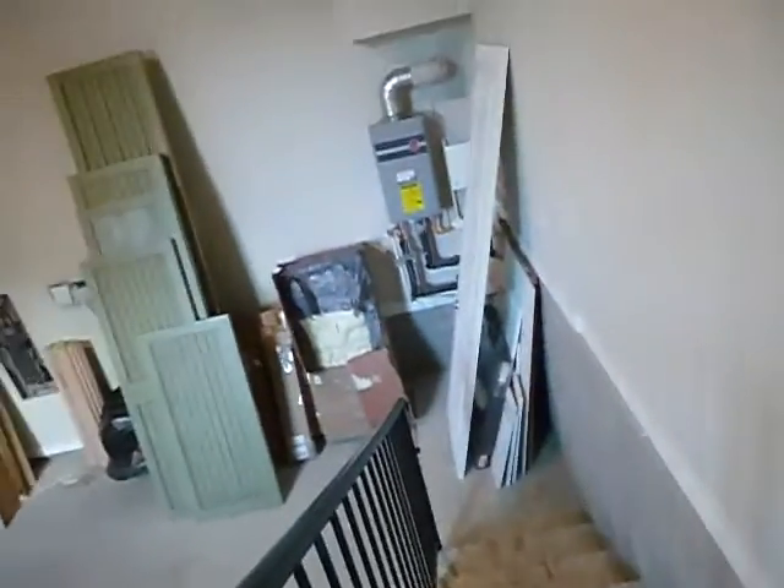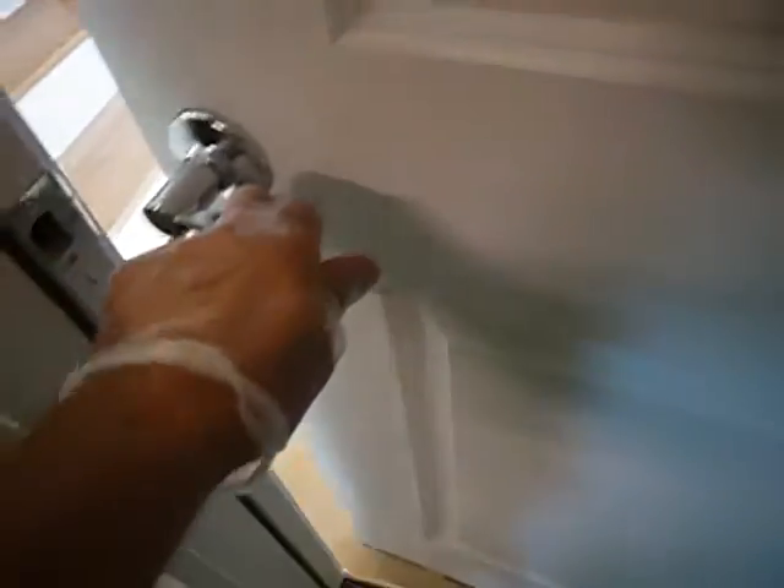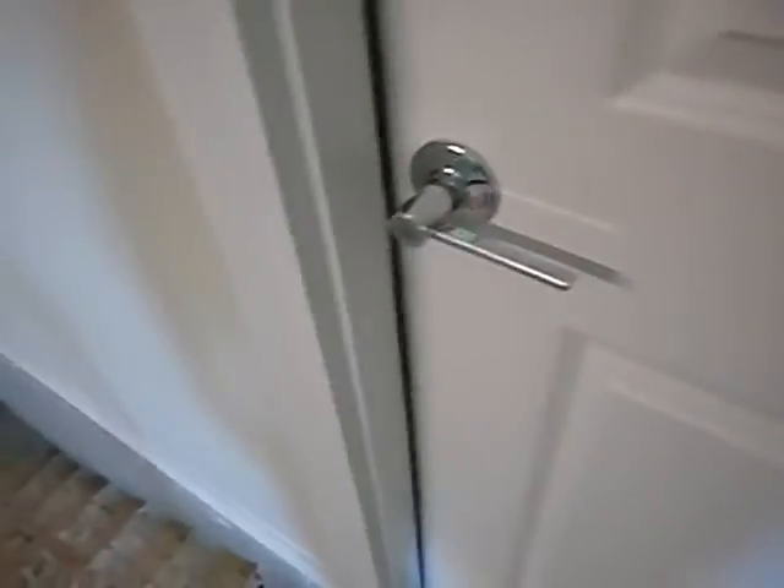This is the garage tour. This is the garage pedestrian door that goes into the living space. It should have a self-closing spring on it, because as it is now, if there were a fire in the garage, there's nothing to keep it from spreading into the living space. You're supposed to have self-closing springs on those doors.